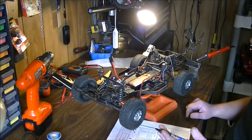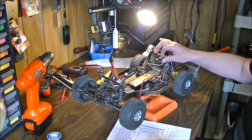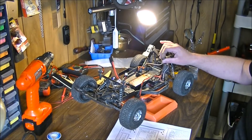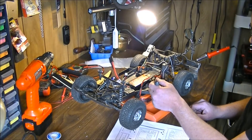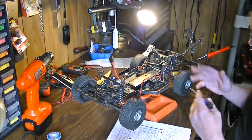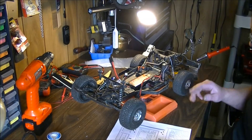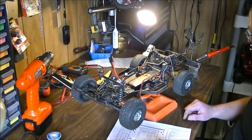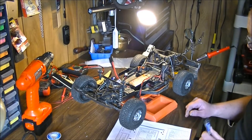The programmer switch that was on the ESC was actually shot, so I managed to replace it and put one up on a wire with a waterproof micro switch. I also JB welded the contacts so nothing could pull at it and dirt can't get in there at all — keeps it nice and waterproof. It is a waterproof ESC and motor regardless.